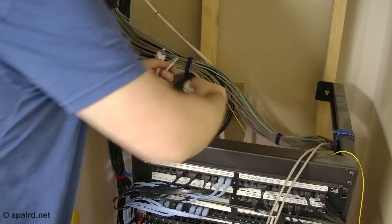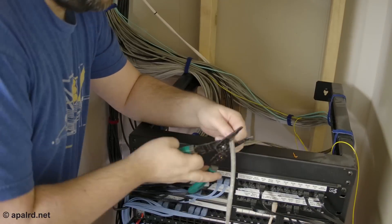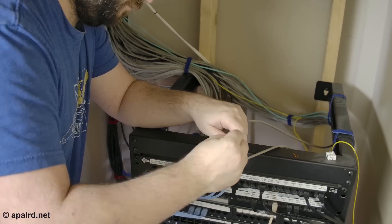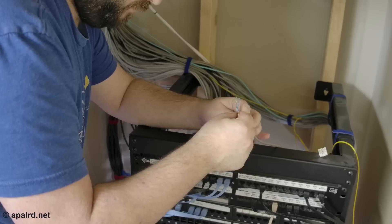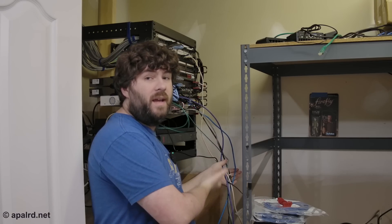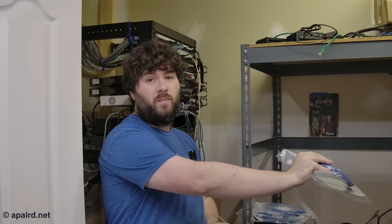I've been bringing a lot of new cables around on the left, so I decided to start these guys on the right just to kind of balance out the patch panel a bit. Then I do the usual TIA-568B dance with the punch-down tool. I really don't mind 110-style patch panels — I rather like them. But in this case since I had fiber, I did a keystone instead.